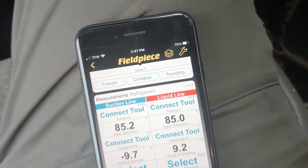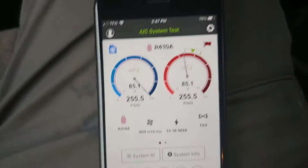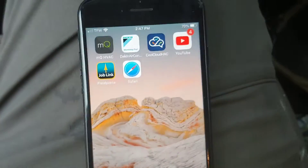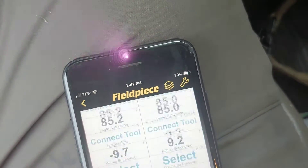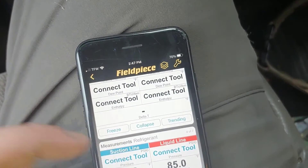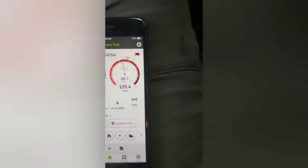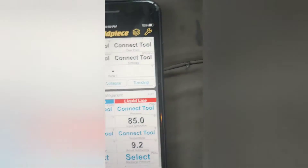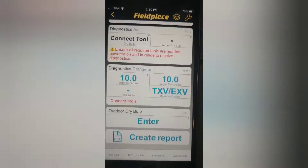I don't know why it's saying 'connect tool' — I got my tools out there. It's reading 255.5. I've got my S-man out there doing a pressure test right now. Job Link's still acting kind of funny — I'd rather use Measure Quick anyways. We haven't lost any pressure; it's probably been about 10 minutes. I've got the S-man doing a tightness test so we can see exactly how long. My guess is, with 100% humidity outside, the chances of some moisture getting in there is pretty good — it might be boiling off.